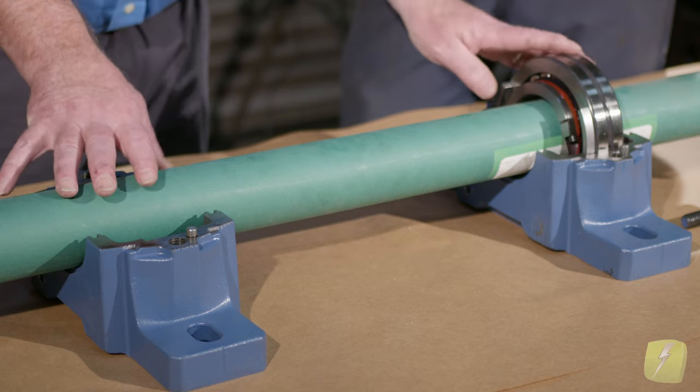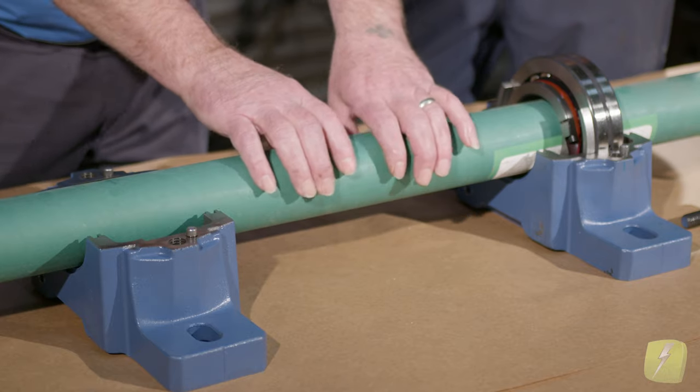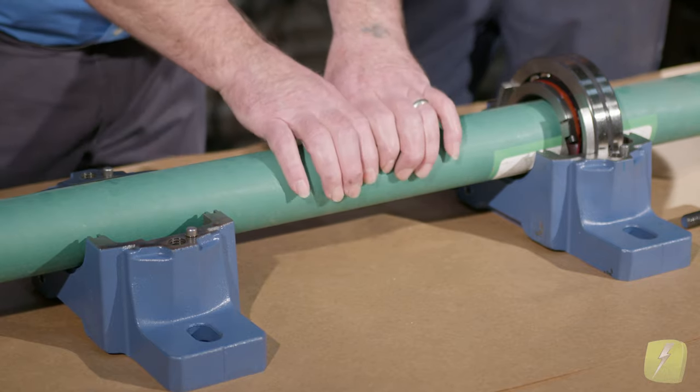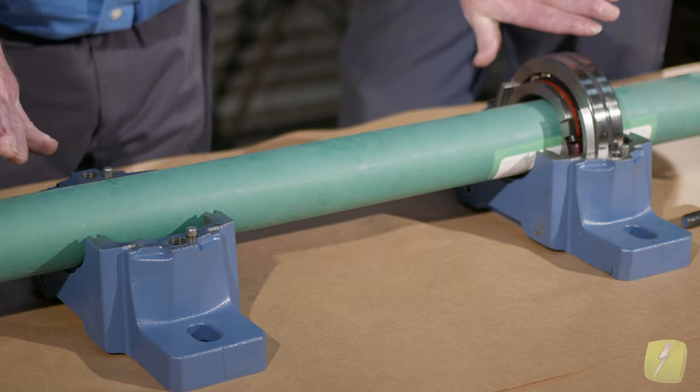We think we've got a motor that's run for almost an hour on the pad, our bearings are stabilized, we don't see any problems. The customer gets it, and now we start to have bearing failure. If we lock both ends, the shaft's still going to grow, and at that point it could grow either way — it has no place to go except to bend in the middle, or preload both bearings until one decides it's got enough room to take up the thermal growth.